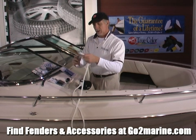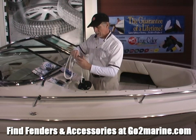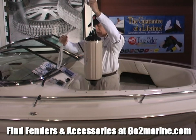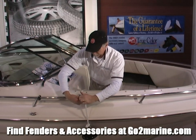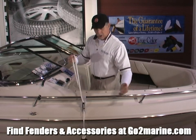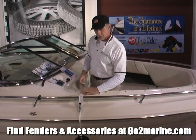And to use it, you simply thread your rope, anything up to a 1/2 inch, thread it up through. This knurled barb pinches the rope to hold it in place. Mount the adjuster over your railing or stanchion. Secure it to keep it in place. And then to adjust it, you simply take the pressure off of the knurled roller, raise the fender up or down, let it secure again.